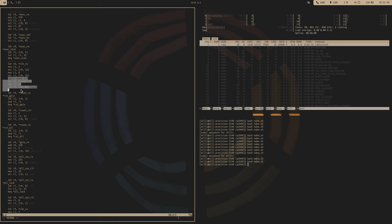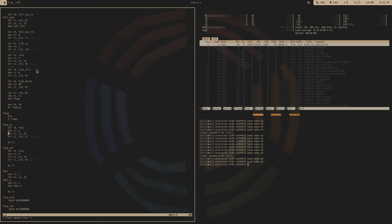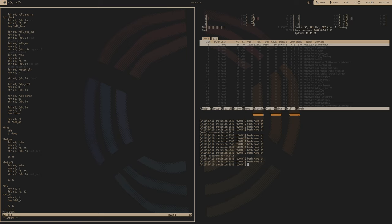Now let's copy this loop up here. All we need is these lines. Just come down here and put it right here. Instead of the 25th bit, we'll reset the 24th bit, so just shift this over 24 times. This should give us full access to the DPRAM.